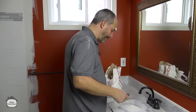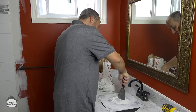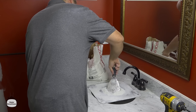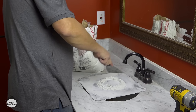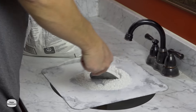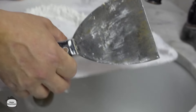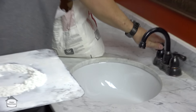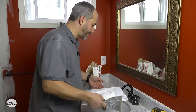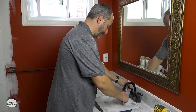Take your hawk and set it over your sink, and you just want to make a little bit of a volcano. This is easier to do with a lot of it, harder to do with a little. You really want to set up a little bit of a volcano. Now, before you get started, the secret here is hot running water — make sure you get the water running first, and once it's hot, bring it into your volcano. This will take a little practice to get used to how much water to put in.